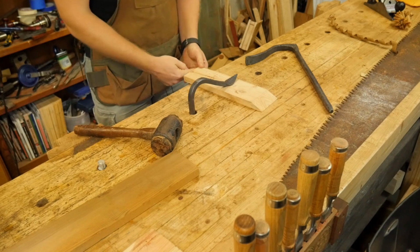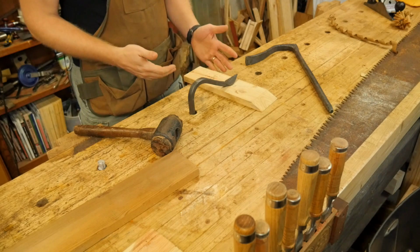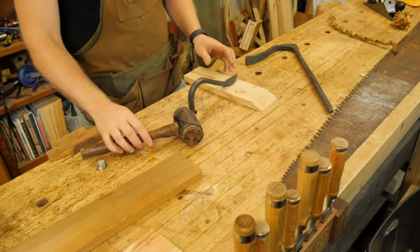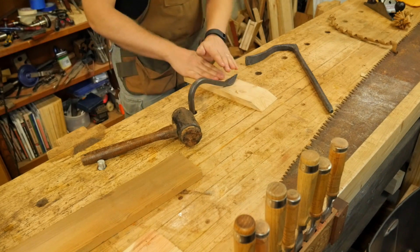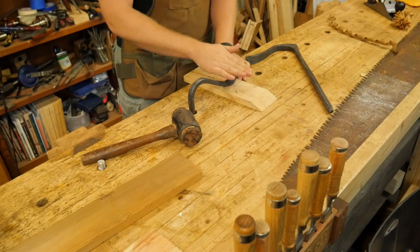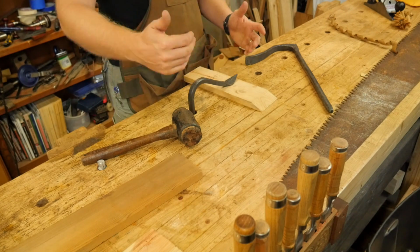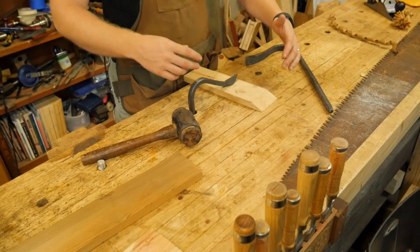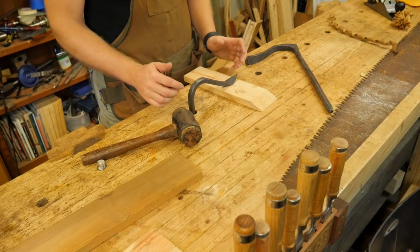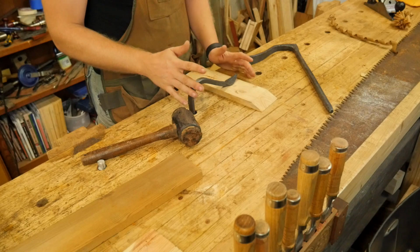And now I can work on the end of the board. And so with this one simple device, I can do all of that work. The one drawback is if I'm working on its face, I'm going to have this vise, this head in the way, so I'm not going to be able to go all the way across the board. That can be easily remedied by having a second board to hold either end that the Holdfast holds, and that can actually be very beneficial. And I go into that in the other video very much in detail.